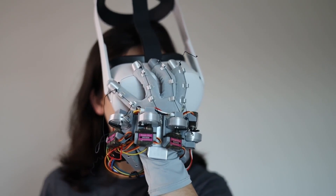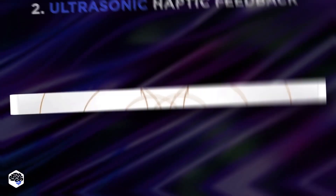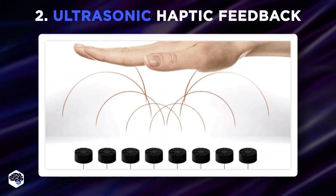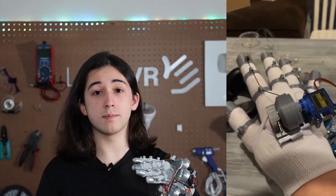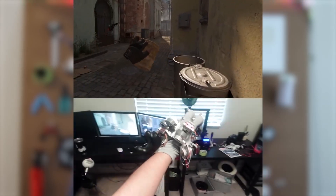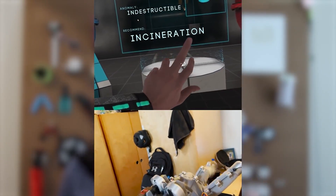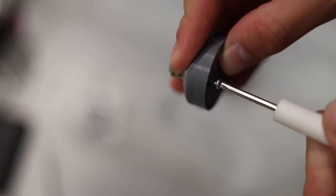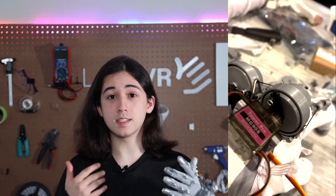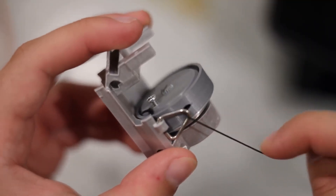Fundamentally, haptic feedback is all about creating artificial tactile feedback from simulated experiences. There's a handful of different technologies to express haptic feedback, but Lucas is going for force feedback — he wants to be able to feel virtual objects in his hands. To achieve this, he only needed to make a small modification to his original design. There's now a screw protruding from the rotor that senses the position of each finger, and then a servo motor pivots to restrict the movement range of that rotor.